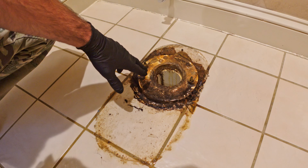Next, we're going to put the hardware on to tighten up the toilet to the floor. First is this plastic piece with this side up, then the washer, then the nut — go to finger tight right now, then do the other side. Now it's fully tightened down. Be careful not to over-tighten, as the cap area is porcelain and it can crack. You'll probably find the cap won't fit because the bolt is too long, so you'll have to cut the bolt with a hacksaw. There's a line marked where it's meant to be cut — give yourself a little space and a couple of threads still left.